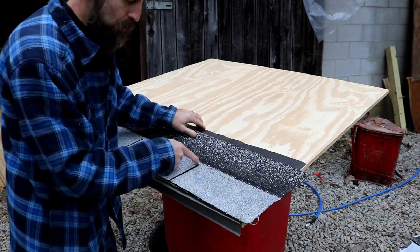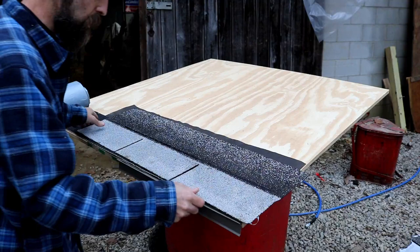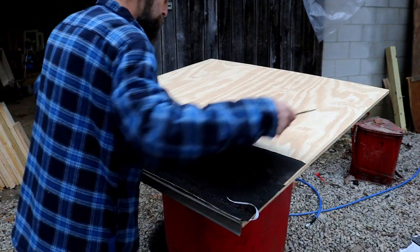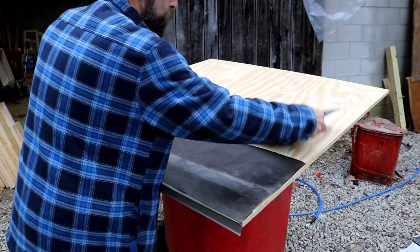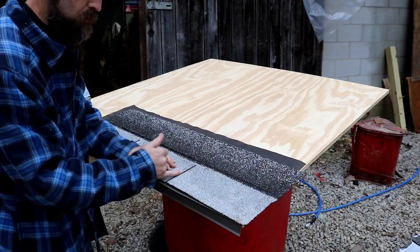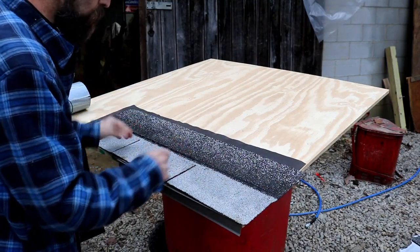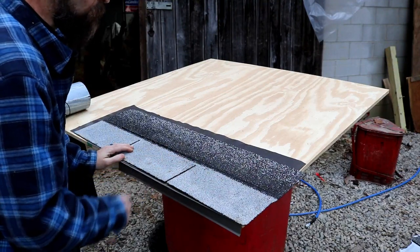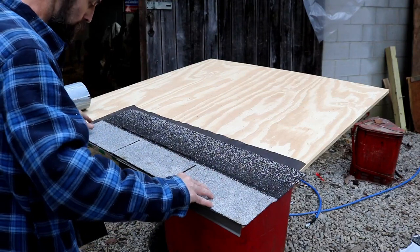And it also gives you protection in that first gap on your three-tab shingles, that first row of gaps. Without a starter strip, you'd have no protection on that first row. You'd basically be exposed to the sun and the rain right on your vapor barrier, which if you used felt paper, wouldn't last long, and you'd have a leak and it would rot out the bottom of your roof, and there you go. It wouldn't be good.